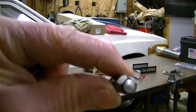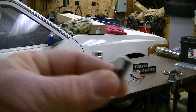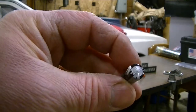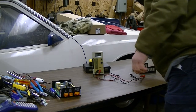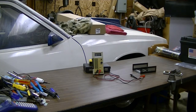I did some testing of the rest of this power supply. I originally thought — and I actually stated in another person's video — that the ultra-fast diode was shorted and that one of the MOSFETs was bad. That was incorrect. Once I unsoldered these capacitors and removed them, both of those items seem to test okay, but I have yet to remove them from the circuit — I'm testing them in circuit. That is a common problem for a switching supply or any power supply. The electrolytic capacitors over time will dry up; you don't have the correct oxide layer and they'll eventually fail.